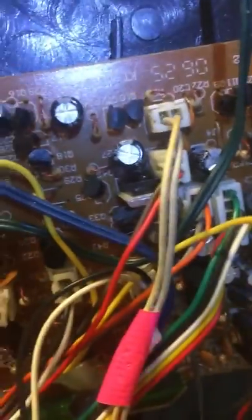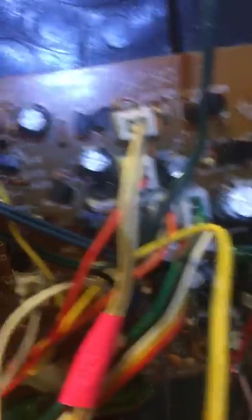There are several ways to determine which channels are faulty — you can plug a motor into it as suggested, or you can use a multimeter. When you turn it on, you pull out the connector and test the two pins underneath for voltage.